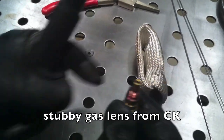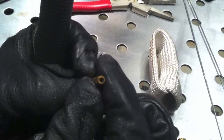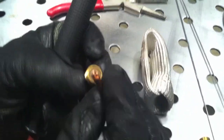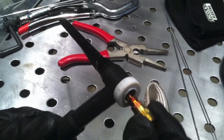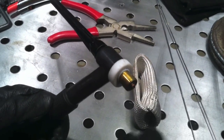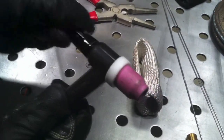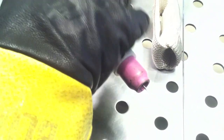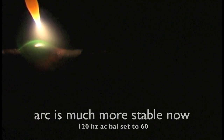I'm swapping to a smaller electrode. What I'm using is a stubby gas lens from CK Worldwide, which lets you use a small gas lens cup — like the number 7 you see on the table — with a large number 17 air-cooled torch. That makes the 17 torch a lot more manageable and useful in tight spots. Unless I need the full amperage capability of the 17, I'm fine with the stubby. I'm dropping down to a 1/16 inch electrode, sharpened to a nice point, and that arc is much more stable.